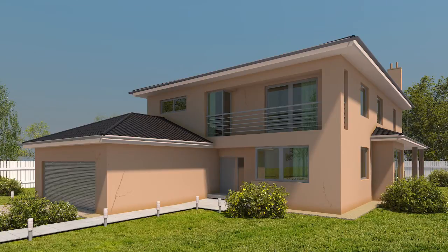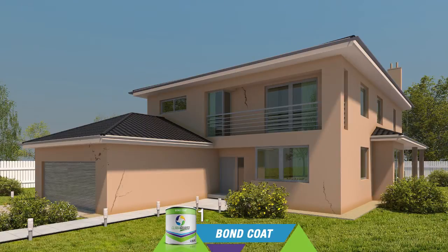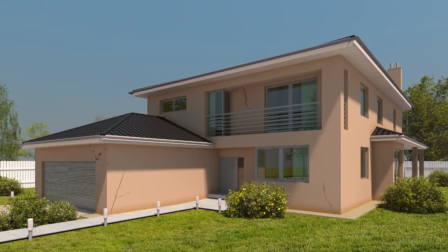After drying, we gouge out all cracks with a V-ing tool and then apply our bond coat, which goes on white and dries clear. This coat will give us a solid bond to the existing substrate, sealing against moisture while reducing chipping, flaking, and chalking. Next, we bridge and fill all the cracks with our specially formulated flexible compound and caulk all the seams, vertical and horizontal, sealing all joints, even on wood siding homes.